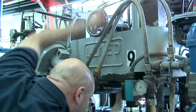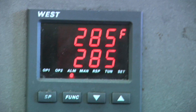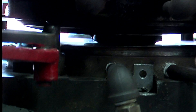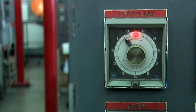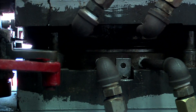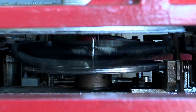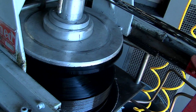The record mold that's holding the stamper is a steel block with channels in it where the steam runs through to heat up the mold. Then the vinyl goes in, gets lined up with a center pin with the two labels, and then it goes under about 1,800 pounds of pressure and closes. Then the steam shuts off and a water valve opens, allowing water to go through those same channels to cool off the record. Once it's cooled, it's carried out by the flash — the excess that's pressed out — and then it's trimmed. If you've never seen this done, it's kind of like making waffles.